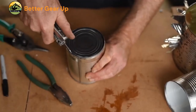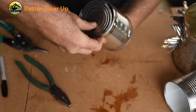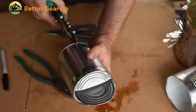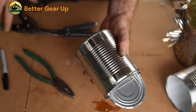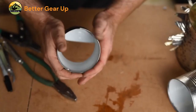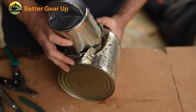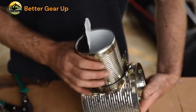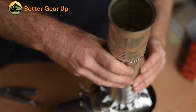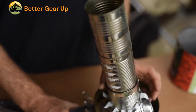Step 12: Bend down the tips of the triangles to lock the wire in place. Make the fuel/air feed tube. Step 13: Take another medium can and make a cut about two-thirds of the way around the inside circumference of the can's base, leaving two centimeter gaps of uncut metal. Step 14: Bend the resulting larger flap of metal outward to about 90 degrees to make a shelf for the wood to rest on. Step 15: Cut a one centimeter slit in the wall of the can opposite the shelf and bend the wall inward slightly so the can will fit inside the other medium can or combustion chamber.